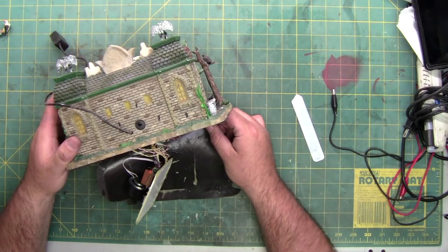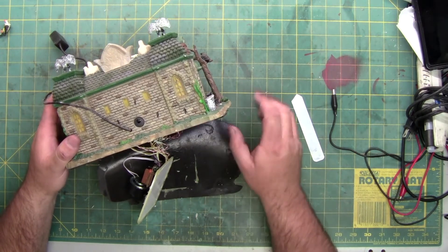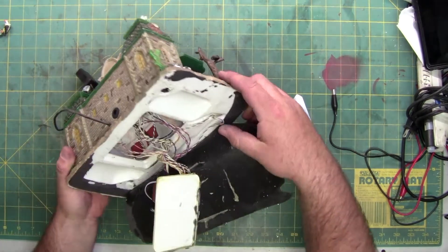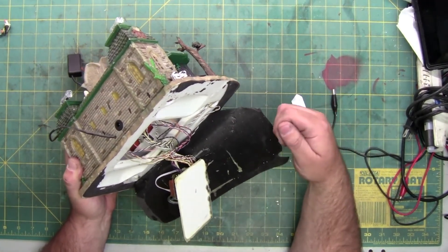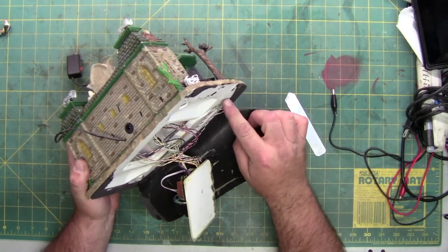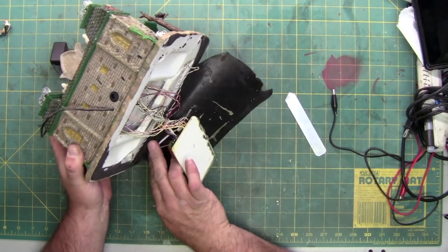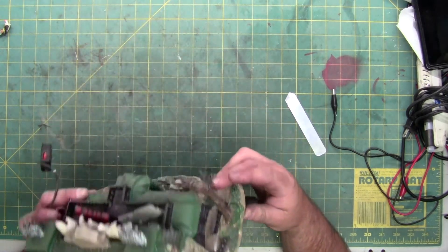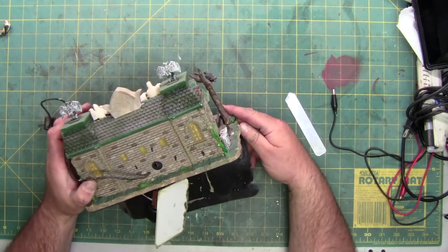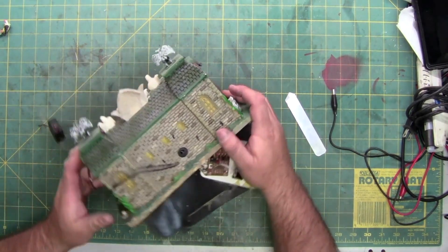At least on this one, there is a purple and white wire that runs along the front side that was stuck to the mat. Be careful if you're going in here with an exacto knife — which is why I like using a spudger — you'd slice these right off. They're also stuck to the mat so as you pull there's a chance you can rip the wires off; they go to the two lights down here on either side.